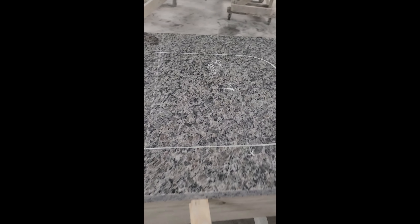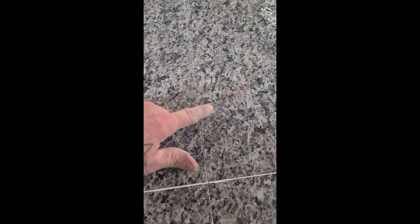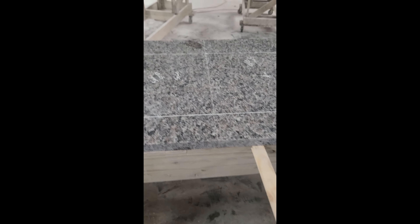All sink fronts get a four-inch setback unless otherwise specified by the customer or if it's too small and we need to manipulate it — which we'd talk over with the customer. I always make sure I've got at least five inches in the back for the faucet backsplash riser. My center line is my cut for the seam. Now I'm going to cut this out, fab it, polish it, back-cut it, and run the seam phantom on it for a nice tight seam.